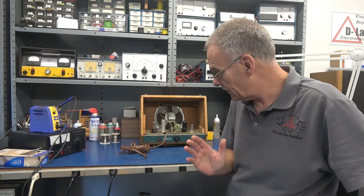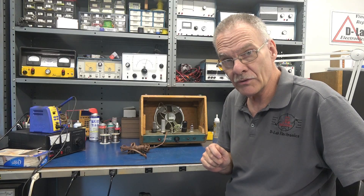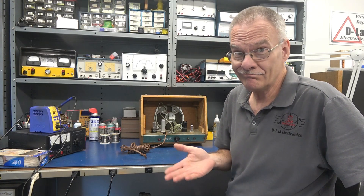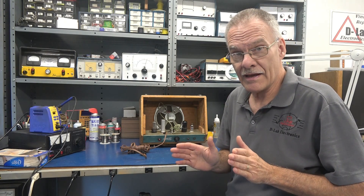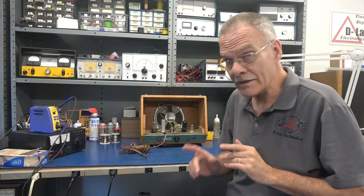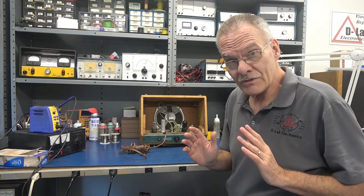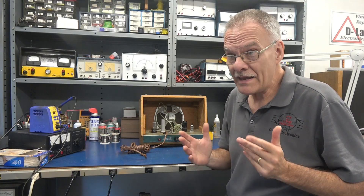On the bench today I've got a cool vintage Magna Starlet Amplifier built in 1955. It says Magna, but is that really Magnatone? Don't know. This amp is one of those hot chassis models, so it's extremely dangerous to operate, especially if you come in contact with ground and touch that chassis. It'll knock out your fillings. So the task is: make the amp safe and make it sound better.